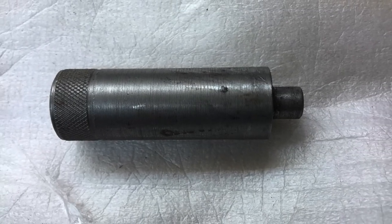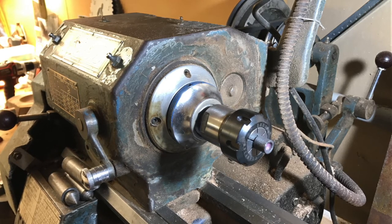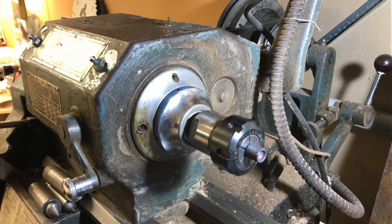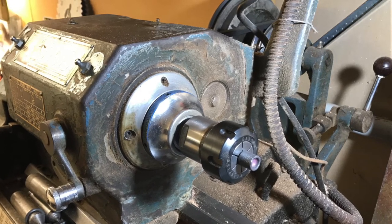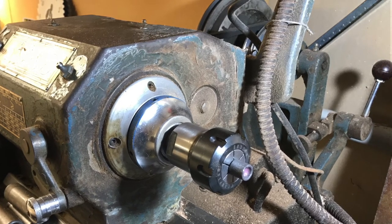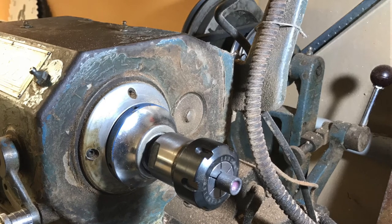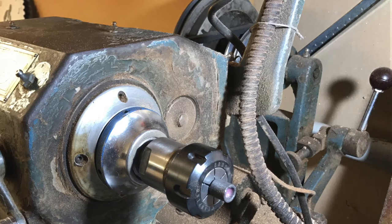This post I made for spinning metal, which we'll see later. This is a fairly standard collet system, which I also imported from China quite cheaply. It replaces the chuck when handling very small objects, holding them very nicely centered and securely. It comes with about seven different sleeves of different sizes, so each sleeve is used for a different-sized object. In this case I've got a little grinding tool in there — I used it to grind one of the tool holders that didn't fit in the quick-change tool post, bolting it down onto the cross slide and sliding the work underneath the grinder until I got it to the right thickness.